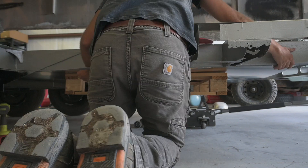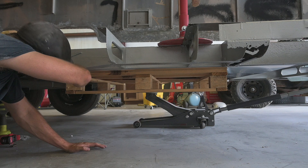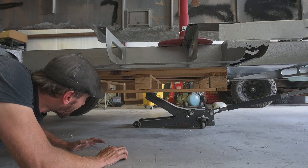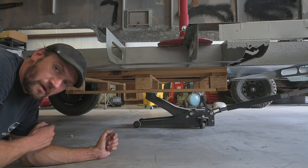I got it in position and this is holding it up. It's overlapping so the front piece overlaps the back piece, so no water when you're driving will go up in there. Now I just need to drill and rivet and work my way forward. I'm actually gonna do the overlap — drill from the front and then rivet from beneath. It'll be a little easier that way. And with the pallet there I can drill just into that.